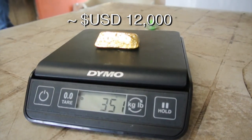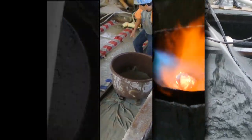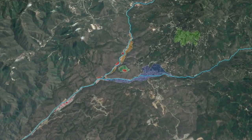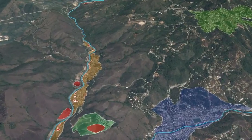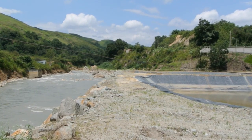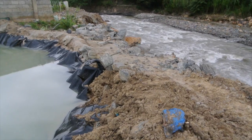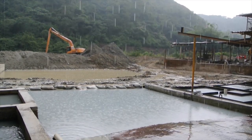In the end, the miner is left with a $12,000 bar of gold at a spot price. We have reviewed how in Porto Velo miners extract their ore, crush it, separate it, isolate the gold, and where the tailings are taken and processed. But where does the mercury go, and what happens to the cyanide? Nearly all of the processing centres in the Porto Velo region are along the edge of a river. This allows them to use as much water as they need for processing, and a convenient place to put their tailings when they are finished with them. The red dots on this map outline tailings facilities that are at the back of the processing centres. All but a few of these tailings facilities are small dugouts, some of them lined, and many only metres from the river's edge. In the majority of the processing centres, the equipment that processes gold gets the most attention. The equipment that processes the tailings is in disrepair and grossly undersized to deal with the quantity of tailings it actually needs to store. It is very common to see tailings where they can escape through this one metre thick wall and into the river, or in other situations where it rains, everything floods and flows into the river.